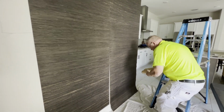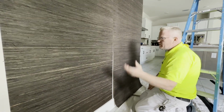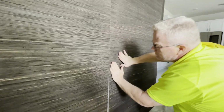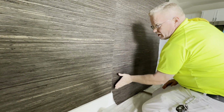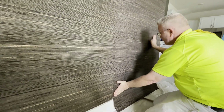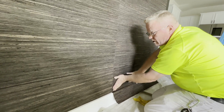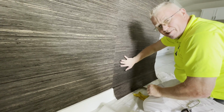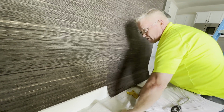We come down here and we see, coming close, that we need to push it in just to bring those seams together. Now watch this. I hold it there, watch this now. What am I doing? I'm preventing the sheet from sliding back away from the adjoining sheet. I'm locking it down, I'm making it stick. So I hold it here until I can get to my brush.